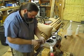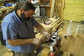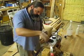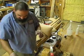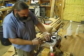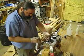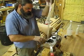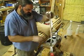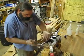Alright. Once you get done with your carbon, you just go back to your fiberglass sleeve and so on and so on. Now there's lots and lots of resin on there. I will not always soak the sleeve or the fiberglass into the cup for resin. The resin is just there to hold the glass together pretty much. Glass is there to hold the resin together, so you don't want too much of either one.